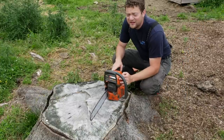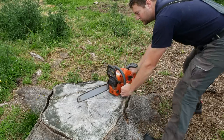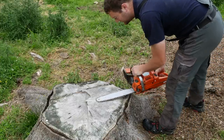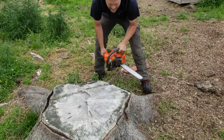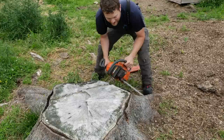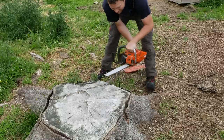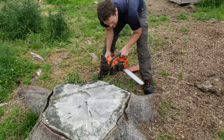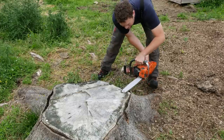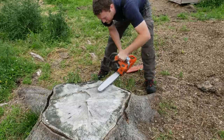If you pay close attention, that never happens in the video, because I didn't put the tip in like that. The safest way to enter your chainsaw is to go like this and enter it into the tree. What I did is I entered it like this — a little more advanced, and I wouldn't recommend it for less experienced people. I never entered the chainsaw tip-first. I entered it first with the pushing chain, not on the tip, and once it's in the tree you can turn it around — now you have the whole tree to protect against kickback — and then you can enter your chainsaw.